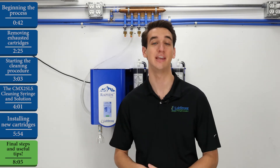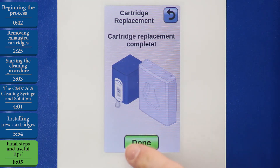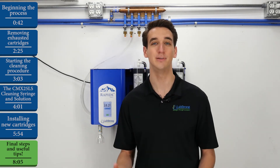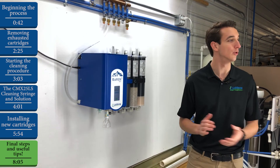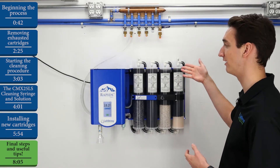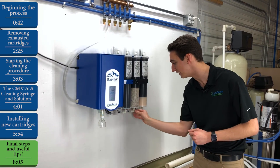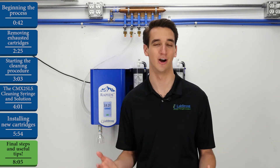But before we do so, we highly recommend checking for leaks within the system. To do this, we'll hit Next, then Done, then turn the system to on mode. All we'll do here is dispense water for about 20 to 30 seconds. These leaks would simply be the result of any of our fittings not being properly attached. If there are leaks as we're dispensing, we'll notice water dripping from any of the fittings on the bottom of the cartridges, or little pools of water forming towards the fittings on top of the cartridges. We can also feel with our hands as we're dispensing and see if any of the fittings feel wet or feel like they might be leaking water. If your system is leaking, we'll have another video coming up about how to check for leaks and fix them if there are any.